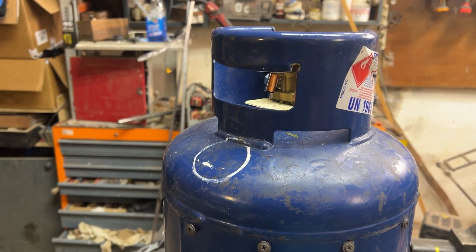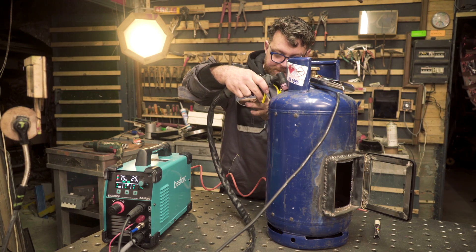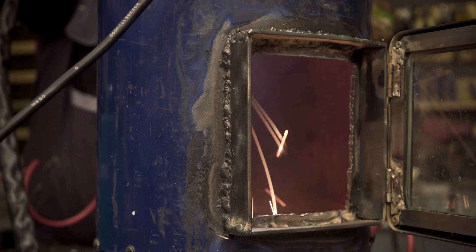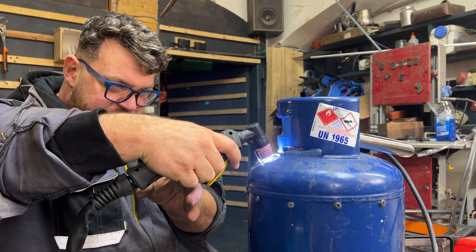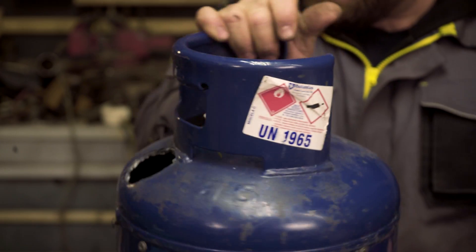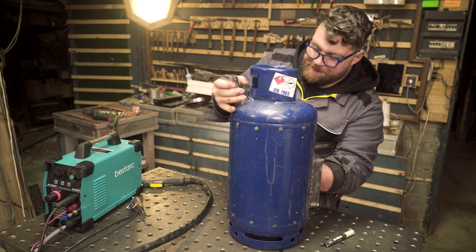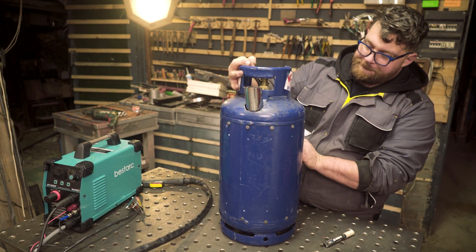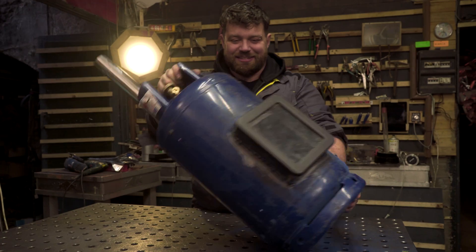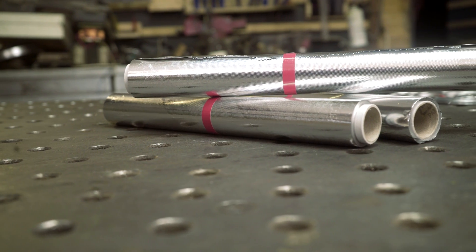I place a chimney on top and making such a small round hole with an angle grinder was almost impossible. With the plasma torch it's so easy — I can cut holes without problems even when they are very small. Even freehand the cut is so precise that the chimney fits perfectly inside. I push the chimney almost halfway inside the stove so that hot air is trapped inside and will boost up the heat.